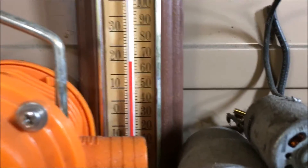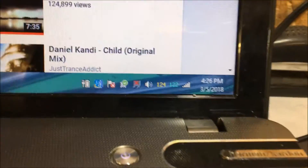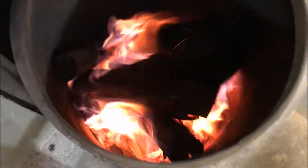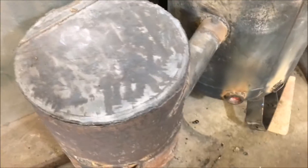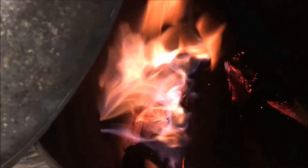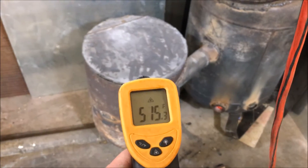All right, we're using a real thermometer here today. We're at about 68.5 degrees room temperature. It's close enough to an hour — we're doing this thing, still running on the same wattage. As you can see, I have pretty much got the fires of hell in there off of some extremely wet wood. See that fire shooting into that hole there — that burns my smoke. That smoke gets burnt inside this area, so it's not like a catalytic cracker, it's more of a thermal cracking configuration that thermally cracks the smoke. I have almost no smoke coming out of this thing. That gets the reclaimer screaming hot — I don't even want to be standing by this thing right now.